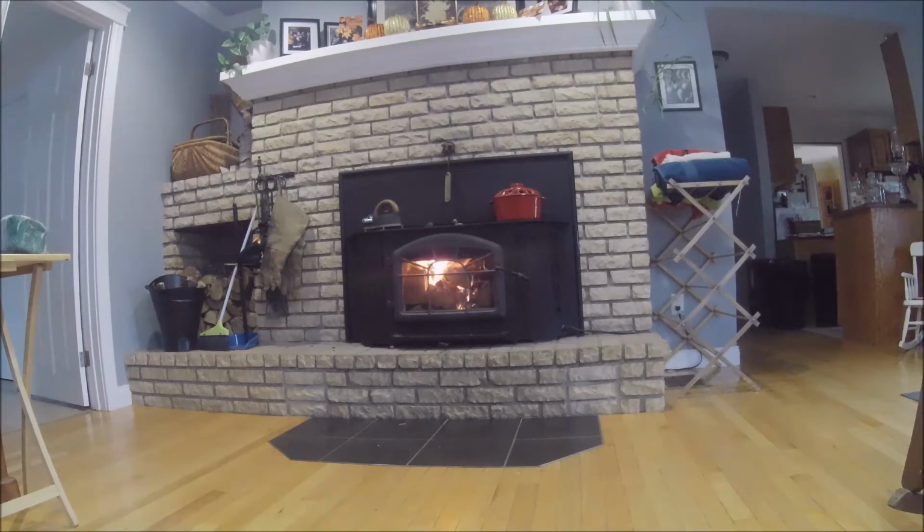So I would think that that fire is well lit right now. And the key to it is stuffing that wood in there like I did, kind of U-shaped, up both walls and across the bottom, and pack it in as tight as you can get it. On the bottom, it's kind of like a wood floor inside the firebox.